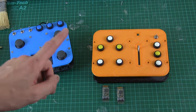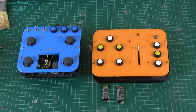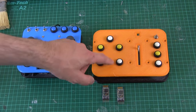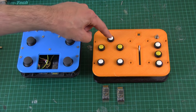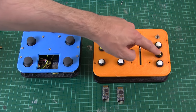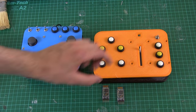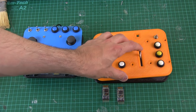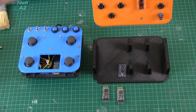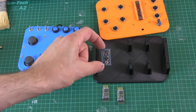Here's my remote for Gonk. This is similar to the remote for BB-8 version three in size, just a bit wider. I could have got the buttons closer together and made it more compact, but I thought it's a nice handheld size, and I can change the front plate by printing a new one and putting more controls on if I want, maybe an LCD. I've got eight digital buttons on here for the various walking functions and some spare for sounds, plus the motor enable toggle and the slide pot which will alter the angle of the box as it's walking around so I can set it and walk along, or puppeteer it to look up at people and make a sound.